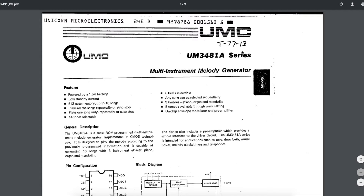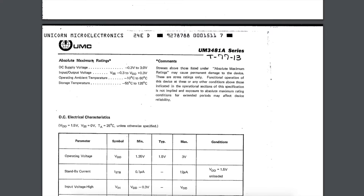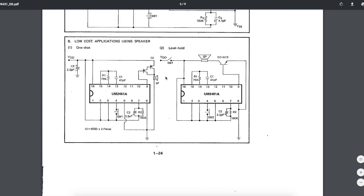Then I found a more elaborate nine-page datasheet for the actual chip series. Again, powered by a 1.5 volt battery, but this time the absolute maximum ratings are only up to three volts — not five like RadioShack said. So I'm operating this at three volts just in case. These circuits are also a little different from the RadioShack ones.